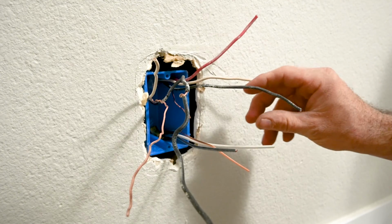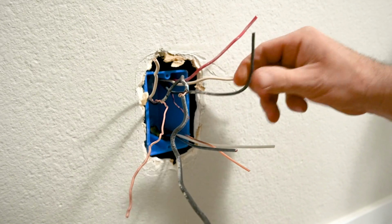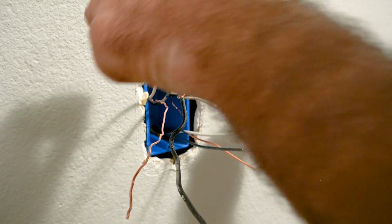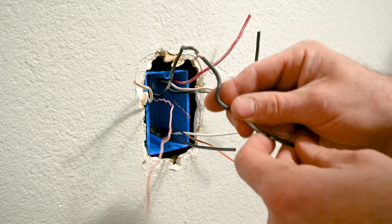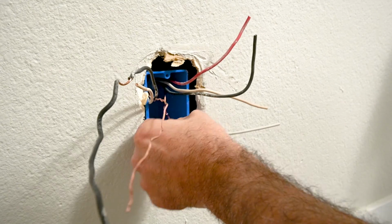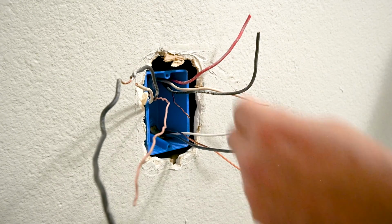Okay, so just to recap, power, main voltage coming in from the light switch. Neutral wire, we're going to put all of the neutrals together, and this is the wire going to power the rest of the outlets, receptacles throughout the room. We have a little problem here. These wires need to stick out at least 6 inches from the back of the box.